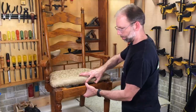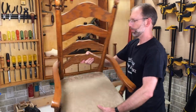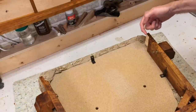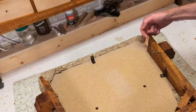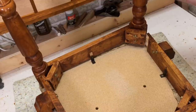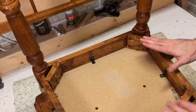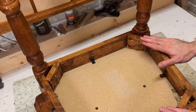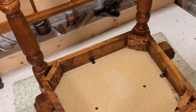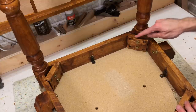I'm going to set this part aside for a minute. At the front here, this lighter piece of wood is where the wood separated — the same here and here. When I bring in the front leg assembly, you can see it's this part here that snapped off. These are semi-formal chairs, which means they don't have any stretchers between the legs, so there's no support to hold them together. That's part of the problem, but there are techniques and woodworking practices that make strong chairs — this is not one of them.